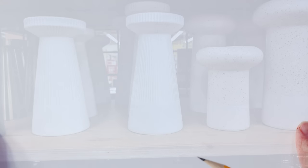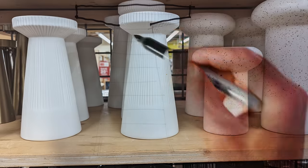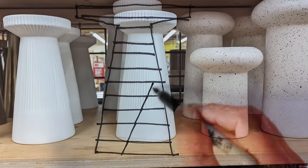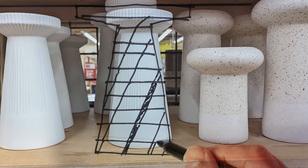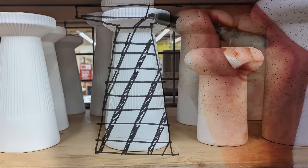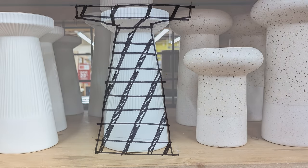We were in one of those knick-knack stores and I was half looking for an idea for this year's ornament project, and I ran across some candle stands that were moderately interesting but they gave me an idea. Maybe I could do a candle stand. I've wanted to do a segmented turning where the segments have a slight angle cut to them — the blade is tipped to an angle — so my idea is to do a simple candle stand and cut the segments at an angle so that I get a spiral pattern.